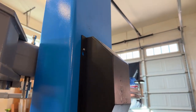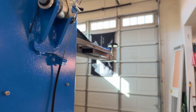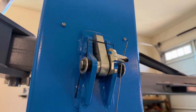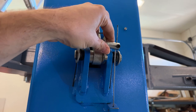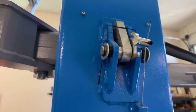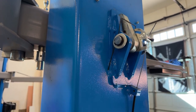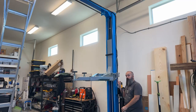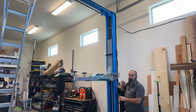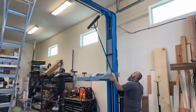On the sides, pop your covers off and double check that you have good adequate tension on your lock cable so that when you go to release it, it releases on both sides. You don't want one getting stuck, the car tilting, and things going badly. While you're raising the lift up, it's also a good opportunity to check your over-height switch or limiter switch at the top to make sure you're not going to crush the roof of a taller vehicle.